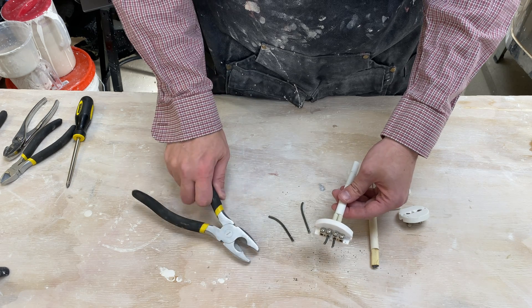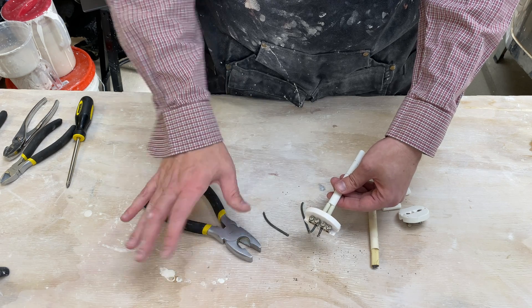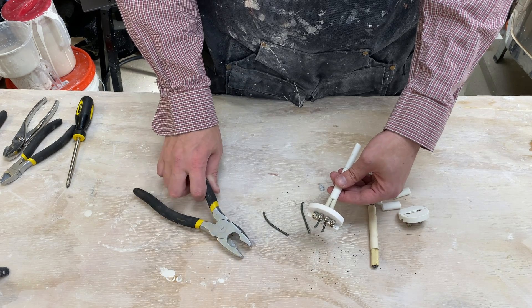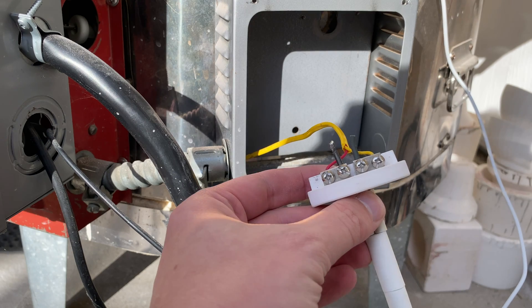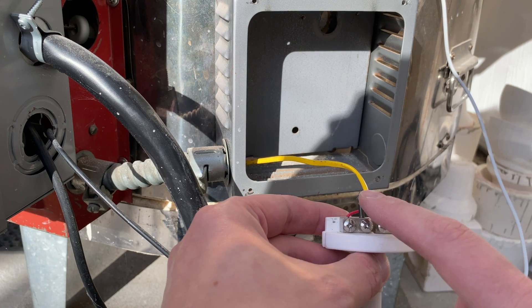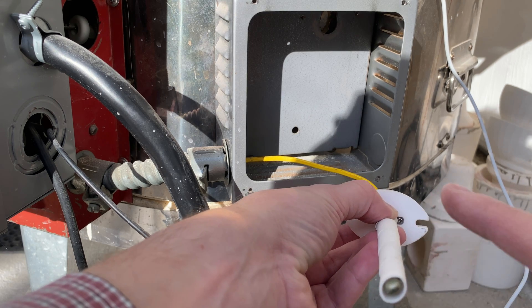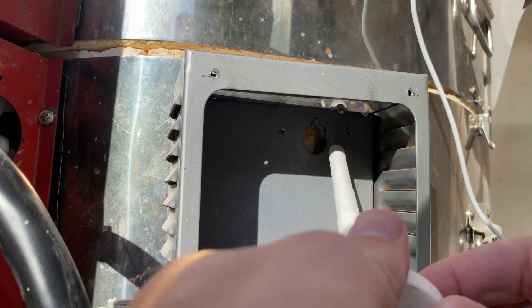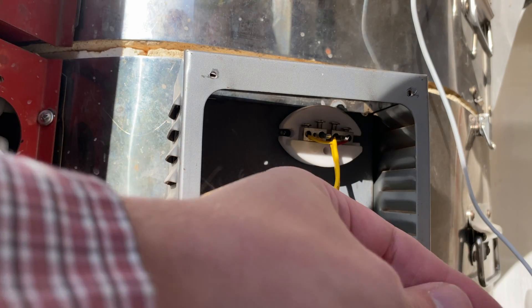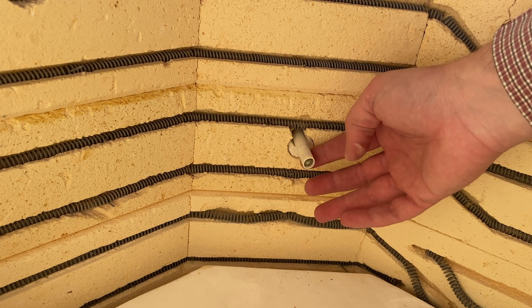The next thing I'll do is trim the legs so it will fit in the box. I forgot to push the record button, but I was able to cut it off — that was not easy. This wire is a very heavy gauge, so I recommend buying the right length wire if at all possible. However, with some persistence I was able to cut it. The reason cutting it doesn't affect the temperature reading is because it's actually measuring the temperature by checking the junction here — that's the semiconductor physics going on. I snaked it back in, found the screw holes, got the screws back in, and there we are back on the inside — it's sticking through about the same amount.